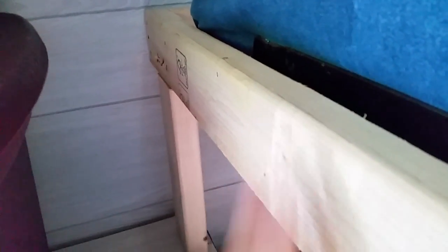This cabinet wall is stained and I can start polyurethane on it today, but I can't get too aggressive because I need the countertop sitting on this one to test the fit. This wall is going to come down and sit on the wheel well, so the wheel well is going to be cut out for it. All these units are going to be modular — I can take them out — and I didn't want the sink cabinet to be dependent on the jackknife sofa. So that's what I got done yesterday, along with the stuff up in the front of the cab.